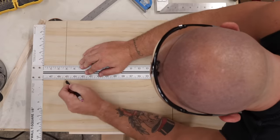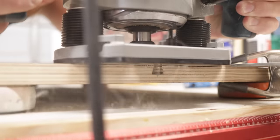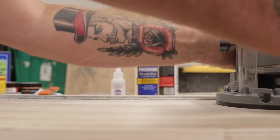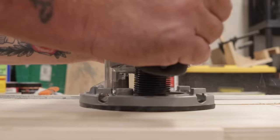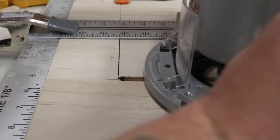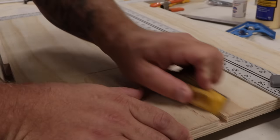Next I set up a line and ran a dovetail perpendicular to the path of the blade. It's really important to make sure the center of that dovetail is at the very front of the teeth on the blade — otherwise you'll have alignment problems, the blade will run on the bearings and give you off measurements. I ran mine all the way up to the blade itself, then cleaned up the track with a little sandpaper.